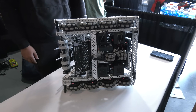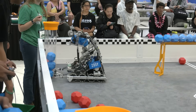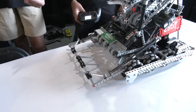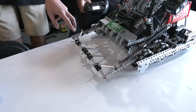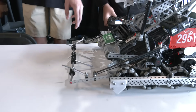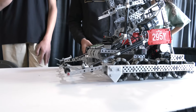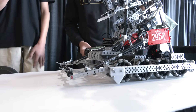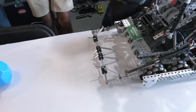The speed is just really nice. Moving on to our match load mechanism — our scraper — just something unique about it: it goes down and wedges the balls up, and then they roll in through our intake. It's braced so it cannot bend. Another thing we do is use two pistons so that one side can't go down more than the other, which improves consistency. We also have screws that protrude out so it doesn't get caught in the little lip of the loader at the bottom.